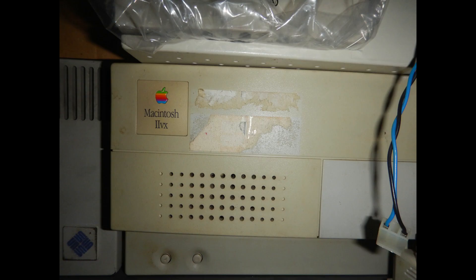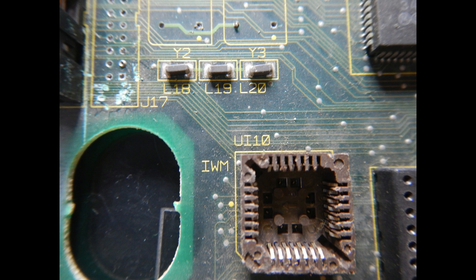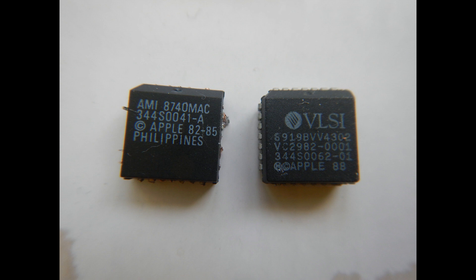The vast majority of the Macs I've kept fall into that last category, even if I might have a few more in really forgotten places. I've never had much interest in repairing them, as Apple had already fully switched to the dark side and no schematics can be found for them even today. However, I've finally found this old motherboard — I think I discarded its case because it was really too broken — and this one has a 28-pin PLCC IWM, and it was even socketed. That's what I was looking for. Now, the part numbers do not match: the original is a 344S0041, and the Macintosh one is a 344S0062.